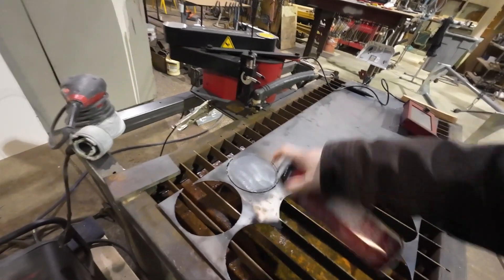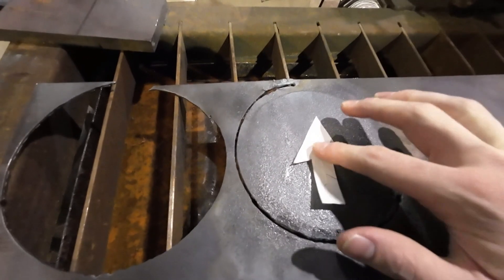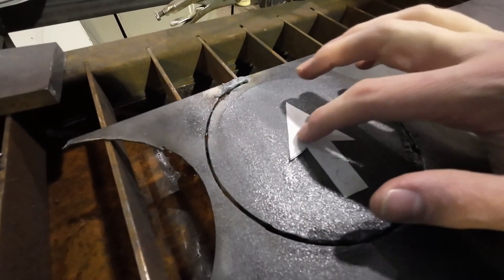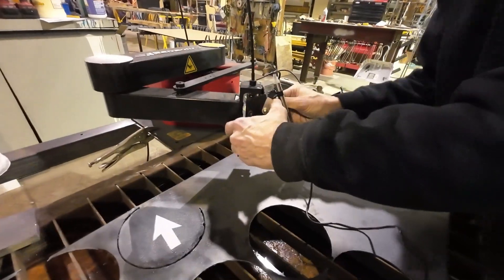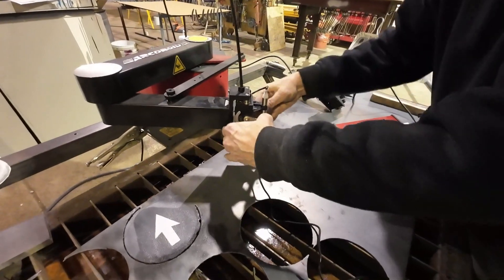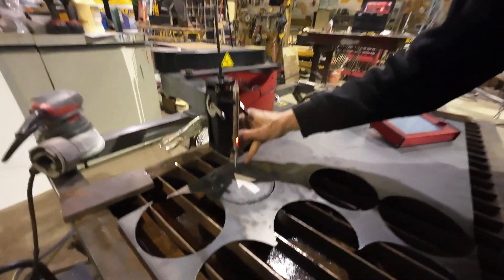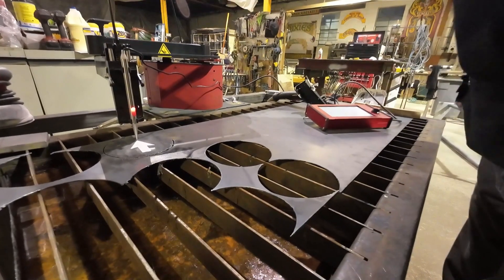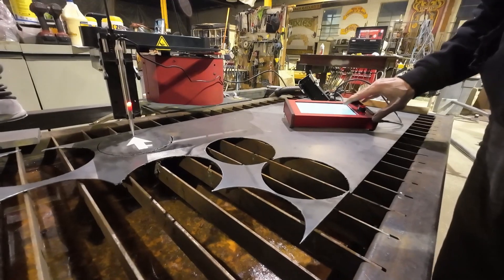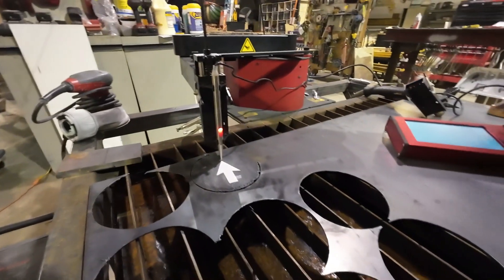You can tell I've never done this before. Here is the first draft of today's arrow. Beautiful. With a stylus — so this is a stylus, this is going to allow us to just trace our pattern, real easy. And once we trace our pattern — there we go. Now we're going to give the Arc Droid a starting point, and that's going to be our zero, right there, so it knows exactly where to start.